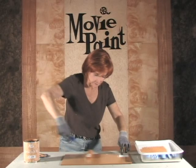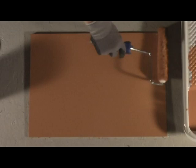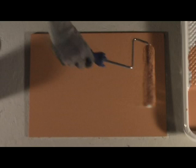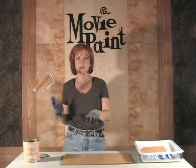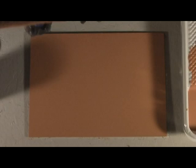First, we'll coat the whole thing. Now we'll just even the whole thing up. You can go the long way or the short way — it doesn't really matter whether it's this way or that way, as long as it's consistent and you get the whole thing nice and even. Now if you see any little holidays, which are spots where the lay-in isn't there, put more on there. You don't want to see any of your white primer or any of the color that was underneath — all you want to see is this color.